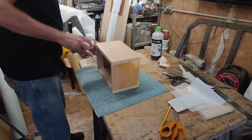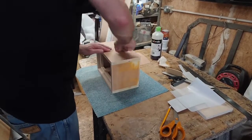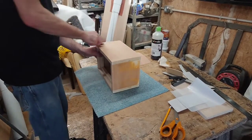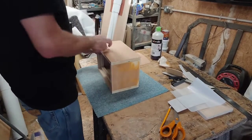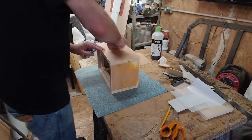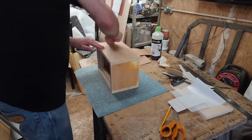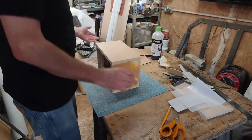Now, if you had a veneer press, you could press this with some PVA underneath it, and you'd find it would press lovely. But this actually is a very good product, and this is the first time I've used this. I've always used, if I wanted to be quick, some contact adhesive like Evo Stick, and that would be a very good thing to use. I've used it on a table once. When I was an apprentice, I made a table for my parents for Christmas one year, and I veneered it with a really nice yew veneer, and I used some crossbanding and everything. This was back in the 80s, and it lasted a while, but then it started to bubble in areas because it's getting use. But with speakers, they're just going to sit there and get no use as such.